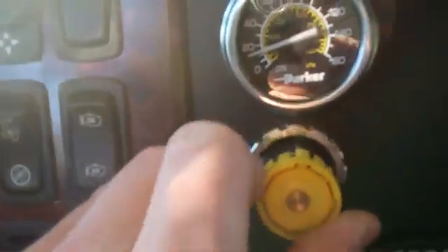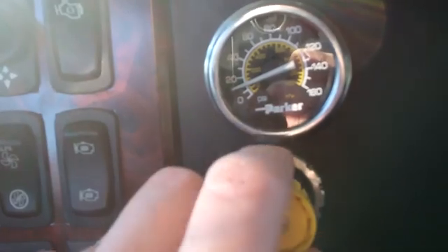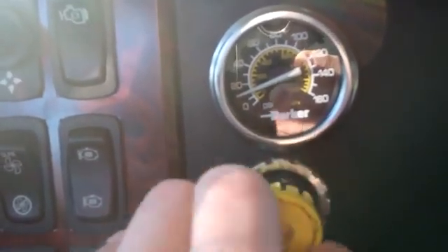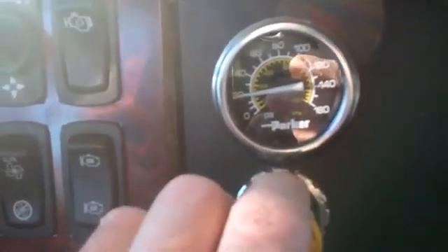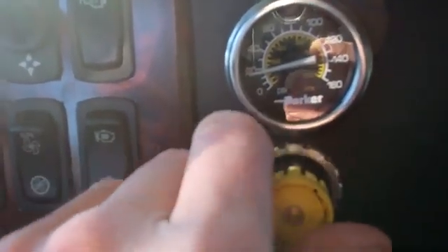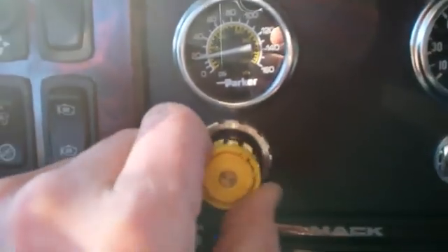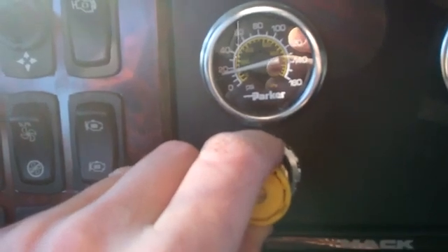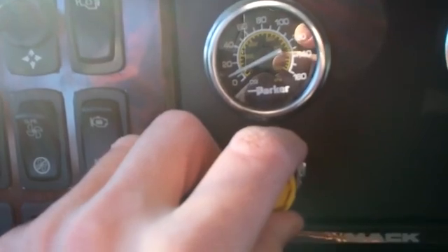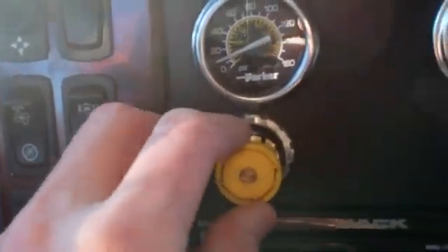See, it's now full of air. The best part is this knob — I can turn it and bring the pressure down. That's PSI pressure. See, now it's at 10 PSI, or I can go up to whatever I want, let's say 20. It takes a little time with some inertia, so you have to turn it back the other direction a little bit, otherwise it'll keep increasing. I don't want too much pressure in there because then it's difficult for the bags to fix themselves when they don't sit right. I'll leave it at around 10 PSI.